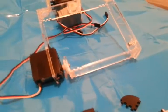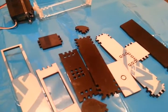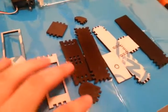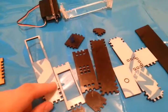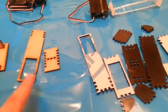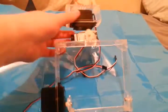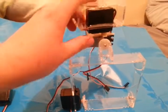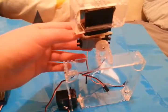For the more complicated design, you're looking at an all-up weight of — I can't quite remember — I think about 20 to 25 grams, because acrylic is heavier and there are more small pieces. All this here is just a protective film on it. Similar design to the other one — they share components like the arms and the top plate — but as you can see it is a very different design. You've got your main servo here, which again goes into another servo. I've drilled a hole into the casing, but you don't need to — you could hot-glue it and strap it with zip ties, and that would be very strong.